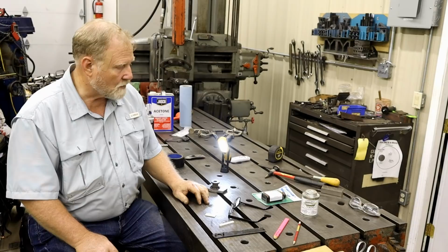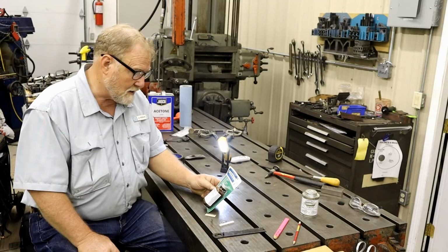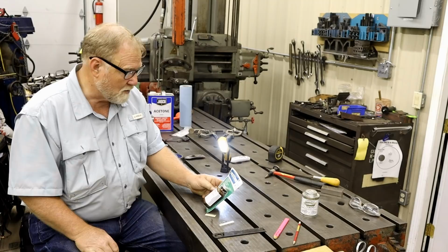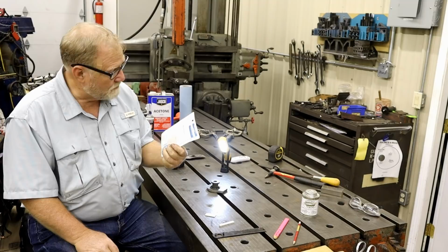So while I was at the Ace Hardware, beside the weld on was this little bottle of glue called Pliobond, P-L-I-O-B-O-N-D 25 LV. It is a special purpose contact adhesive. It says it's for rubber, leather, canvas, steel, fiberglass, everything, a permanent flexible bond, withstands vibration, flexing, and stretching, and it remains flexible and tough from below 0 to 200 degrees Fahrenheit. So I bought it, I've got it here, and I'm going to try it. And if this fails, we'll go get the barge. Heck, we might find a glue that works good.